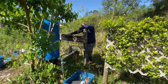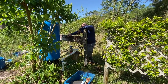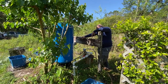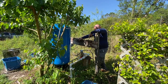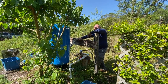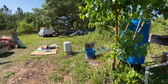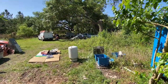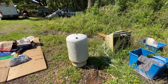It's so nice to not have it clicking on and off all the time. This is a huge game changer for us. The problem was the bladder broke on that other tank — I was checking to see if I could inflate that bladder. The old tank wasn't inflating, so we were pumping straight air into the tank, pumping straight water. There was no bladder left.